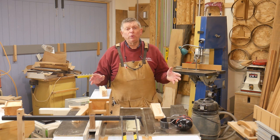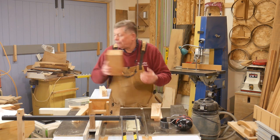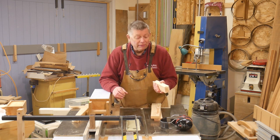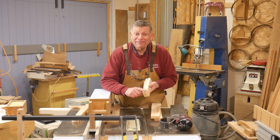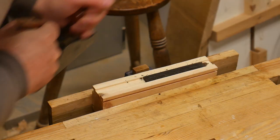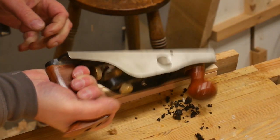There are at least two ways of making the splines to fit the grooves exactly. The first is old school: a block of wood with a groove cut in it, a little bit wider than the spline material will end up. A screw put in one end below the top surface, otherwise you'll spoil your day. Cut a piece oversize, lay it in the groove and plane away, turn it over, plane away, until it's level with the top — and just keep going until it's a Goldilocks fit in that groove.